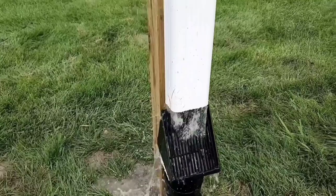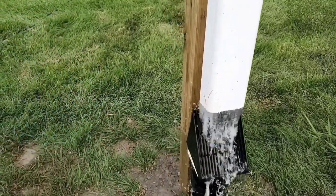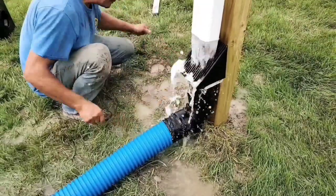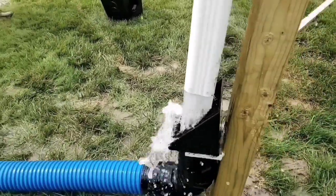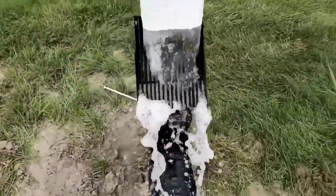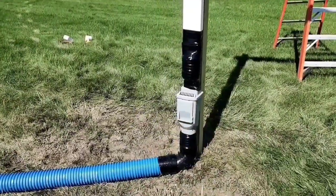We had to adjust each and every one of these. We took time to adjust them all to see where they would perform at their best. One thing that concerns me about anything where you let the water go and then try to re-catch it — if this moves, even after you get it set up just perfect, if you have settling, the ground settles, it's going to drop the underground downspout system. You're going to have the pipe literally drop. This is going to shift and move. This was so sensitive — we played with it and played with it to get it to where it performed its best. And I thought to myself, there's no margin for error here.